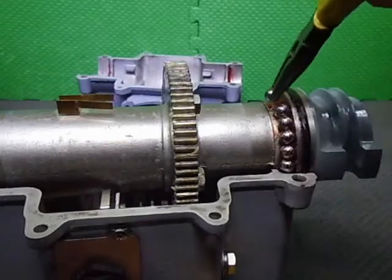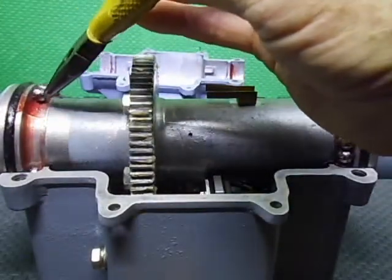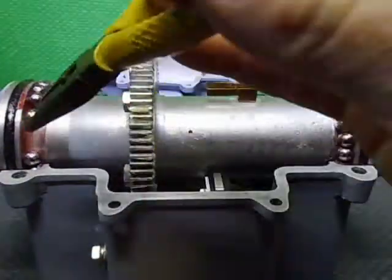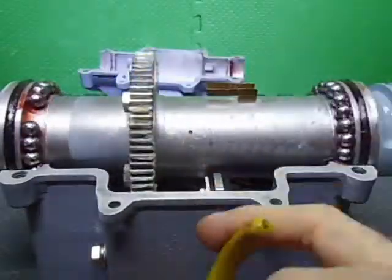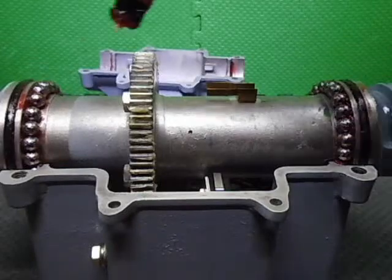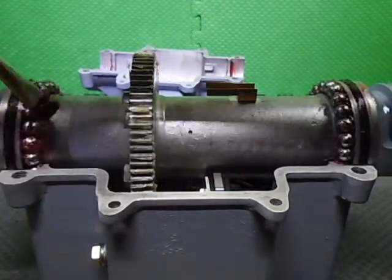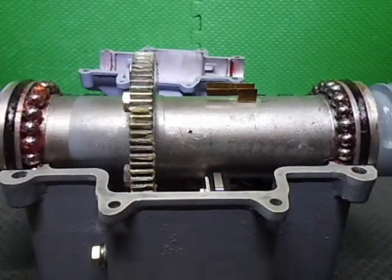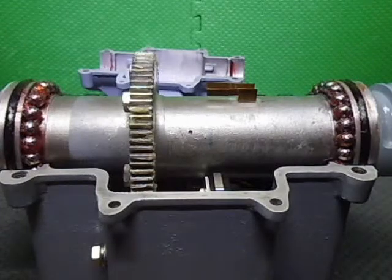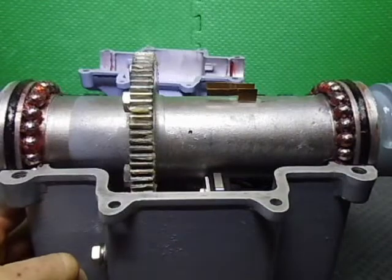Par for the course. So as I was saying, these have 9.5 bearings, and there's 48 of them. Get this all loaded up. Got a bit sparing on the grease this side, so I'll start from the bottom. Don't fall down. I might just add a little more grease there, because it's a bit on the light side. A bit on the outsides of these, just so when I've got a bit there already. I've already done the other half, but I'll just get a bit extra in here. Now the bearings are in.